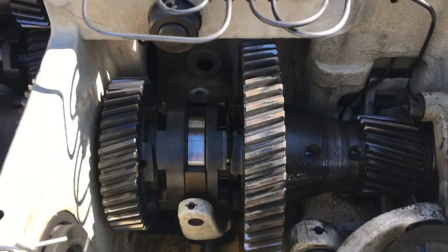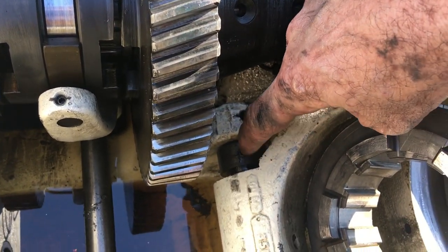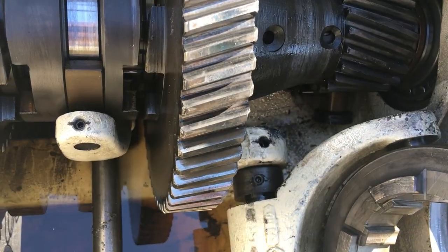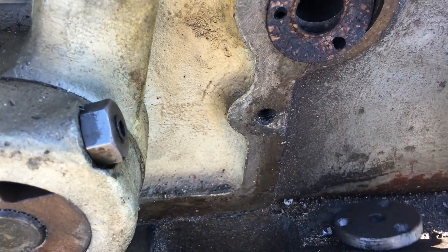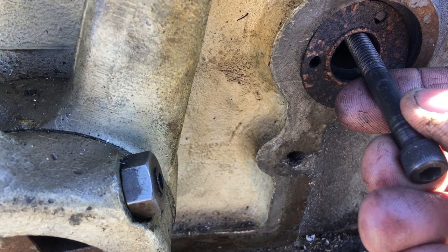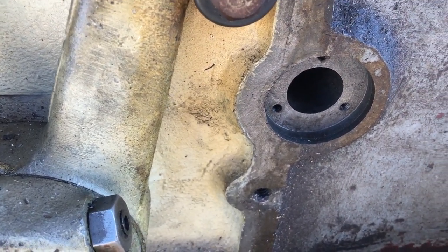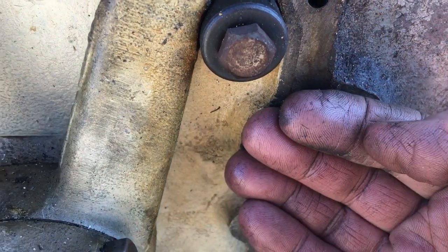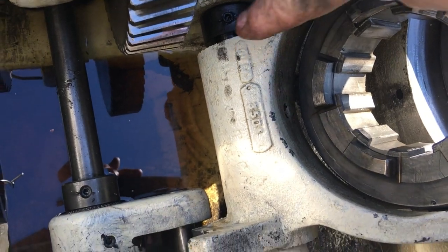We've got the set screw out and this set screw on the lock collar backed out. I'm going to leave it because it was staked and pretty tight — it's backed off and free from the shaft. What we have here is a cork gasket and a little cap that had three screws. That went through the cap and kept the pin located. I'll probably use a slide hammer or 5/16 coarse all-thread to pull that pin — it's got to pull all the way out in order to lift the fork up out of there.